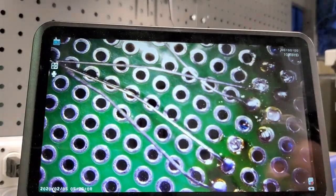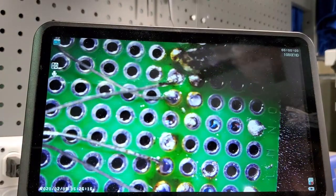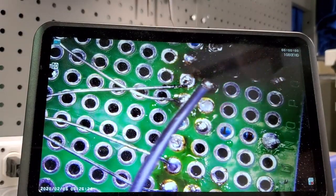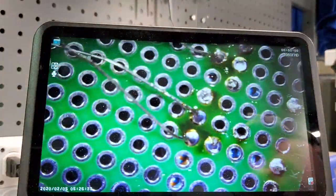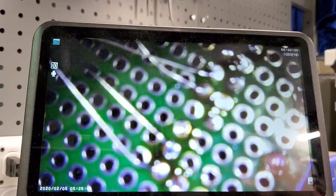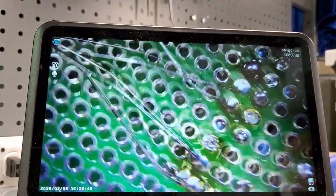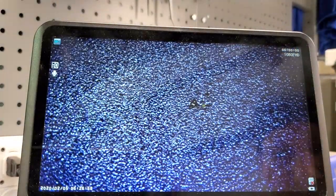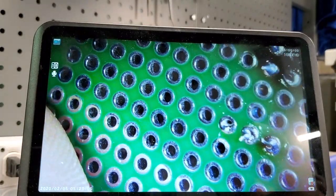Let's check the profile on those. The one I wouldn't like is this very first one — you can see how it formed a little pocket. So I'm going to angle it to get the iron in better, heat it up, and I can see it needs a little bit more solder on that joint. Now check the side profile — they're all perfect little nubs. We clip them off and now we inspect.